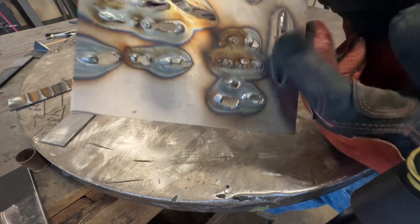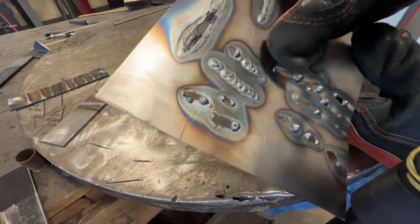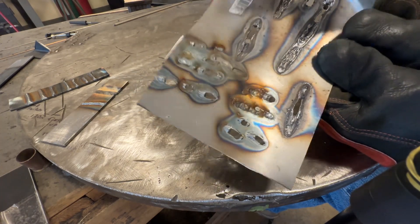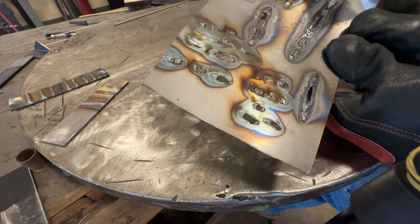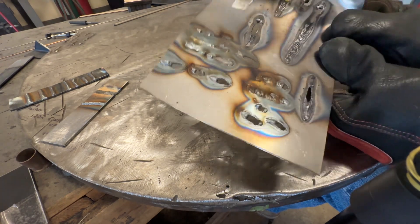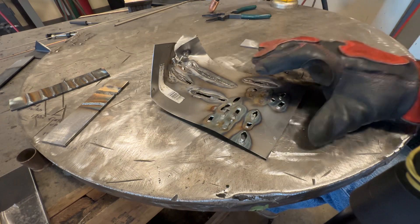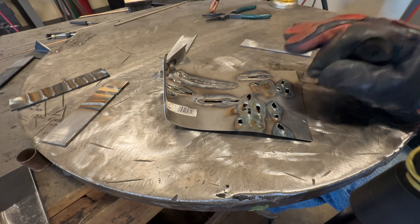Well, it's not pretty. Let's take a look at the back of that — complete pass through. So is it possible to tack weld sheet metal this thin at 19 volts? I would say yes. But is the quality of the weld going to be good? No — it's almost over-reinforced. And if I lower the wire feed any more — I already dropped it to 195 — it's just going to have an arc present and not actually weld. Definitely difficult.